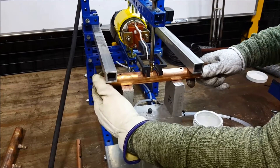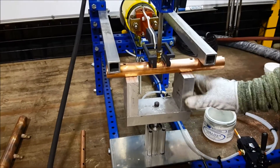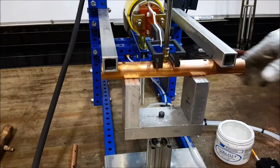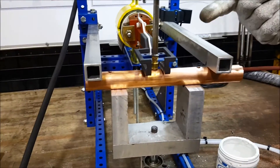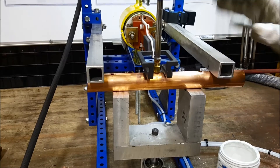This fixture was developed by our Moonshine Group — it was about a day and a half of development time. This is revision one of our fixture, but it is working really good. Now we've got the braze ring in place, Schrader port in place, flux supplied, and positioning confirmed.